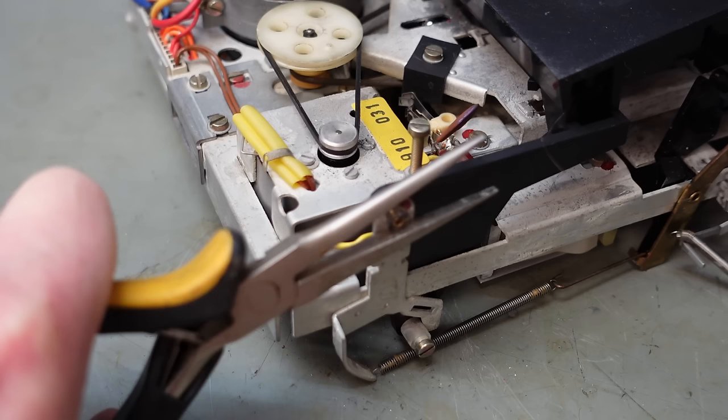Okay, that looks good. Right under my nose is this sticker mentioning DC magnetisation of the heads. Well, that's not a bad shout, so I'm going to demagnetise them. That's all there is to it. And now I'm supposed to plug the heads in. Just get this into the right position and tighten it up. At least it's in nice and solid now, with all new belts, no squeaky parts.